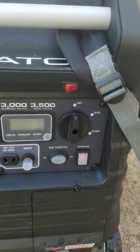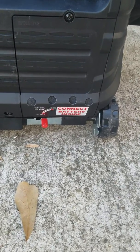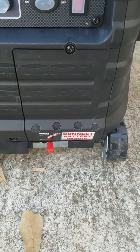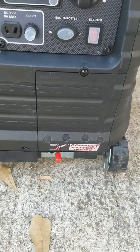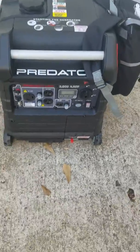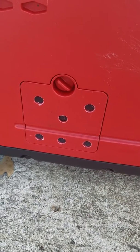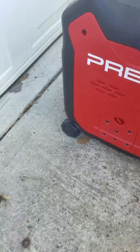I also put a stop switch in there. Those little holes right there that I drilled are so air flow can go through. The intake is so strong that air is actually being sucked through the outlets. To cut down on that, I put some holes here, turned the insulation around, put some super glue on it, and stuck it so the insulation still gives you sound deadening but air can suck through it like a sponge. So air flows through that, and I also did the same on the side of my hole cover — drilled six holes, flipped the insulation around, super-glued it, and now I've got ventilation through there so it runs cooler.